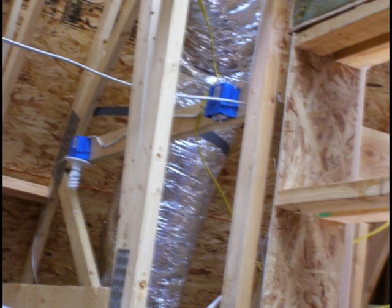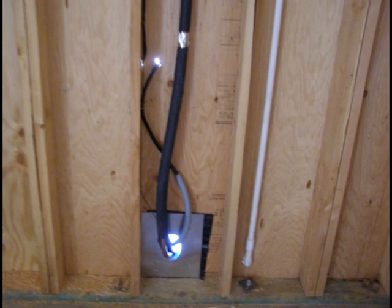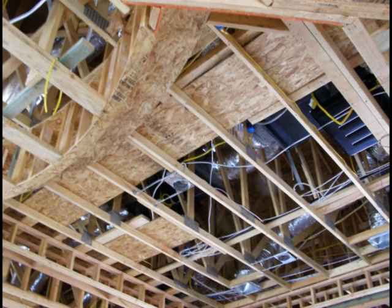In this photo, you see the attic access with the switch and light. Know where the access hole is going to be, even if it's not already framed in. It is important that the HVAC is already installed — that's air conditioning stuff. This way, you know where to run your air conditioning home run. Same goes for the forced air unit as shown in the rafters.